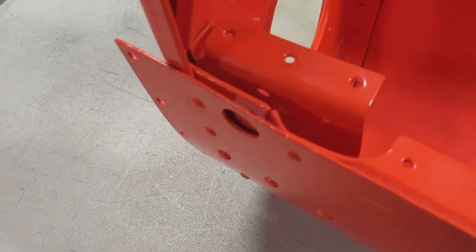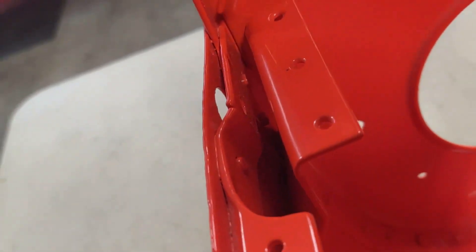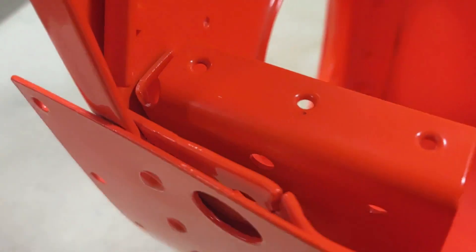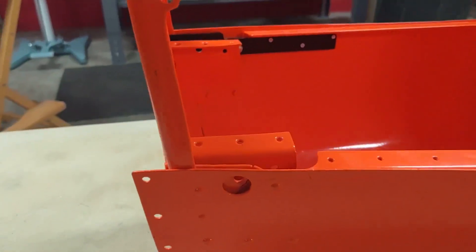I'm going to grab the camera here and try to get a close-up of this crack, show you folks exactly what I'm talking about. Now here we're back — look at that nasty little crack. Isn't that interesting how that breaks? Now a bad crack like this one, you can actually see it through the hinge hole. But otherwise you've still got to pull the tail all off to inspect all these rivets.